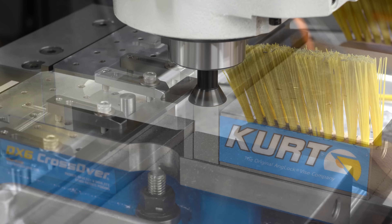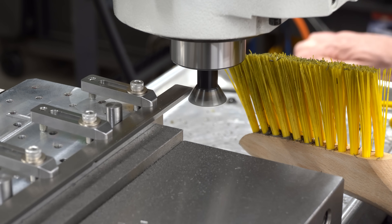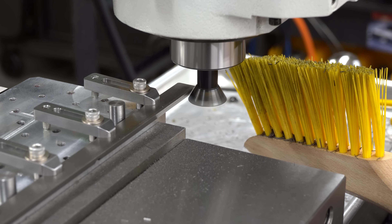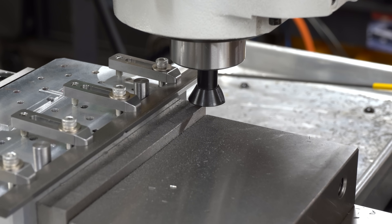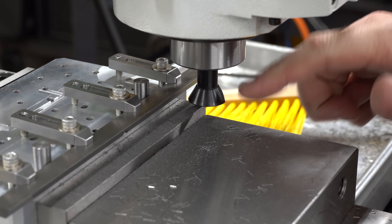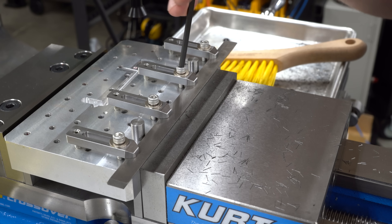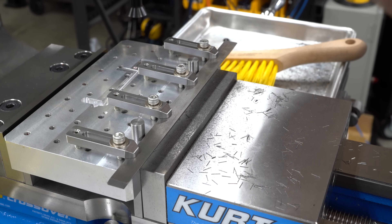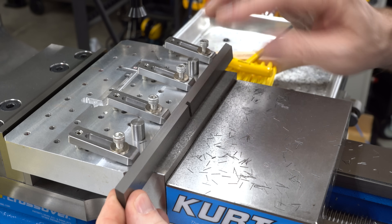The exact amount isn't critical here. I've got the brush just to keep the chips from landing on the floor. Since this is extended past the clamps, I'll go ahead and take a little spring cut climbing back up it, just to make sure that's completely cleaned up. You can see this cutter is peeling off a nice little curl of cast iron right off the gib. Pretty happy with that. Let's get this unclamped and see what the surface looks like — it looks pretty good. Good job, Randy. I like that dovetail cutter.